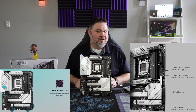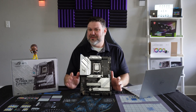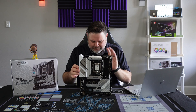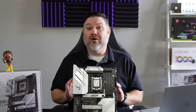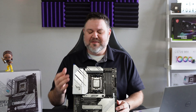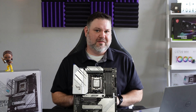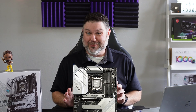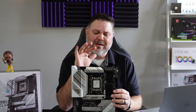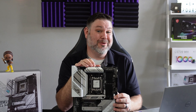Internally, there are more than enough headers to cover whatever RGB, cooling, or internal storage design you ultimately decide to go with, so there are no worries there. On the topic of build quality, the board offers a six-layer PCB. While definitely more than adequate, a lot of other options in this price range are offering at least an eight-layer PCB. It does come equipped with substantial heat sinks over the VRM and all three M.2 slots. The overall design and aesthetic of the board is very nice and more than adequate to fit any all-white or Oreo cookie-style build you might be going with.